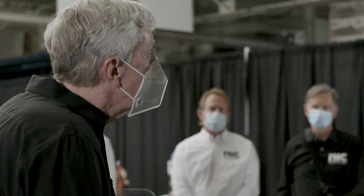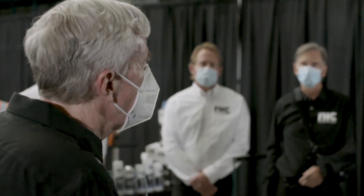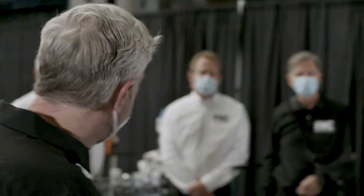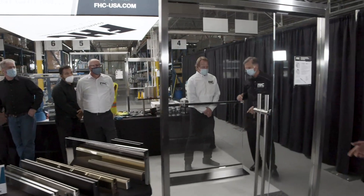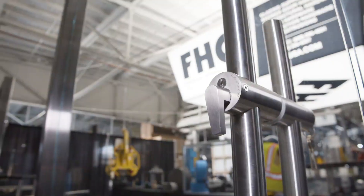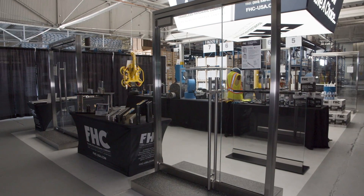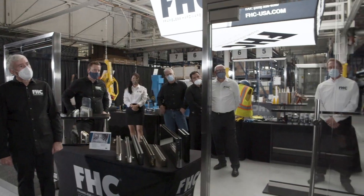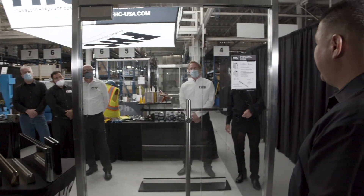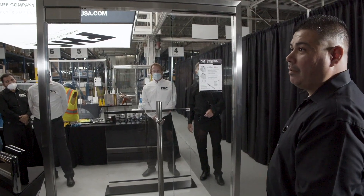That clam-shell end cap is really important — in summer meetings they were discussing how any little flaw on the edge of glass can show up years later by spontaneous shattering of the glass. Here we have our standard ladder pull, a 48-inch ladder pull locking downward, it comes with the ADA thumb turn. Here are our tapered bottom rails, nine-and-a-half inch tapered top patch rail. Here we have our header system: an inch-and-three-quarter by four-inch header with a glazing pocket, no silicone required — it comes with a rolling gasket.